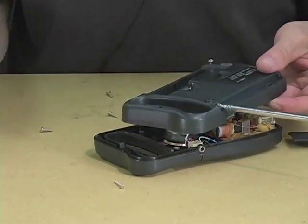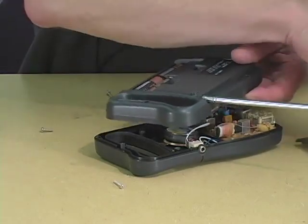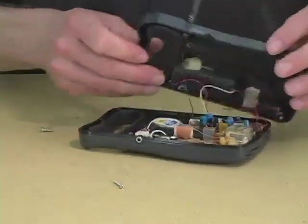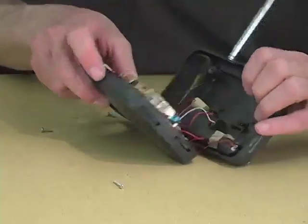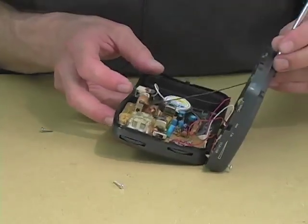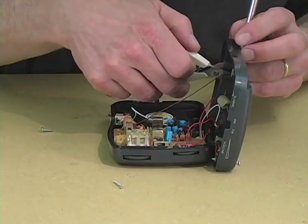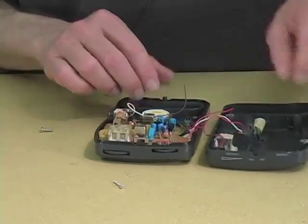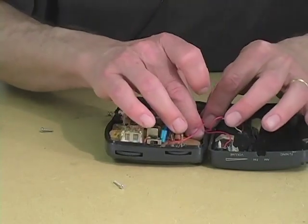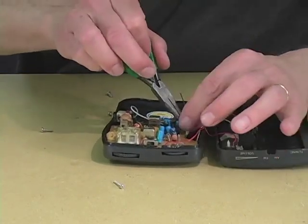Or under the antenna. We're going to put the batteries back in because we do need to have the circuit working. And we're going to very carefully put it over on its side. Now, you will notice that the wires that hold together these types of inexpensive circuits are very fine — they tear quite easily. I'm going to disconnect the antenna since that's not going to be important for us now, so that we can open this up. It makes sense — it's a good idea to make a little note about which wire goes where, so that if they tear part way through the process, you can reconnect them.